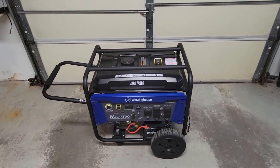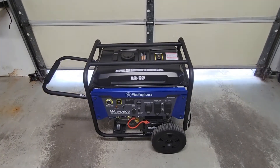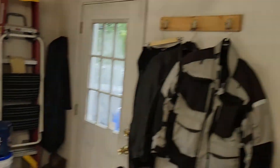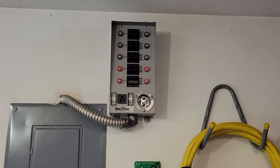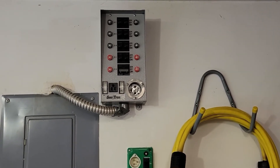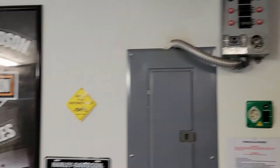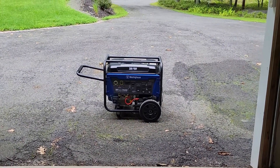Since my generator is stored right next to the garage door, it's very easy to wheel it over and get it outside. In a power failure the garage door is going to have to be opened manually, but today we'll just pop it open. This is where I keep my generator when it's running, and I just want to show you how I attach it to the panel. The transfer switch was put in 20 years ago — I don't think you're technically allowed to put them indoors anymore like I have mine in a garage. You should obviously never run your generator indoors. So I have a 25-foot long cable that goes from the transfer switch right out the garage, and I close the garage door — and that's always how I've used the generator here.